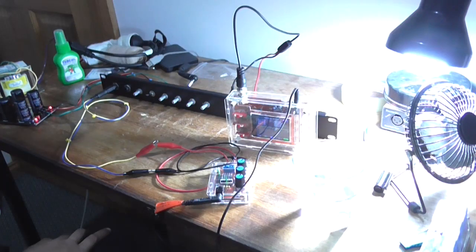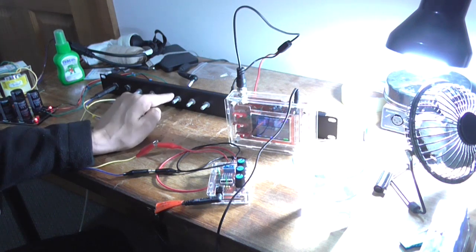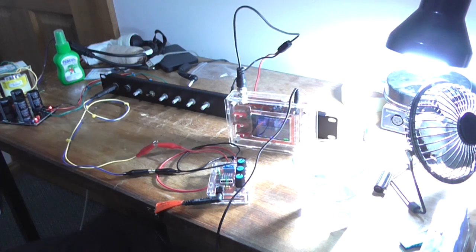So what do I think's going on with it? Well, I think it's most likely the grounding, as I said. So that's the first thing I can try: moving the ground of this control to the ground of these controls and see if that distortion goes away. If it does, it'll be happy days. If it doesn't, well, the only other option I've got is to try changing the pot to a different one.